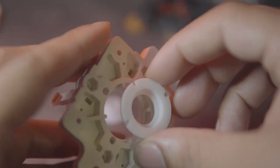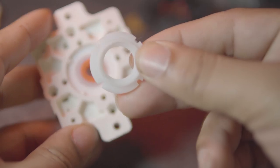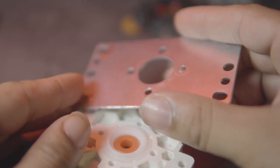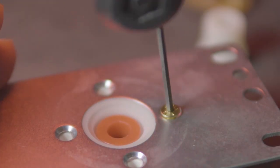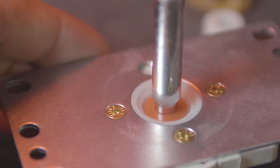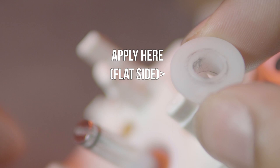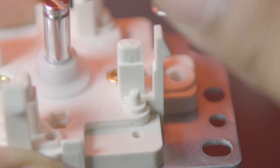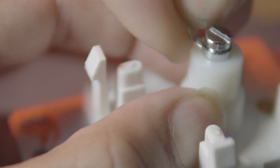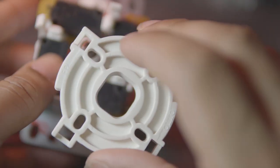From here, grab the body and the corset that's going to hold the grommet system in place, and we can start putting it together. One of the corsets is going to sit on the bottom of the grommet system and the other one on top. After making sure they're all nice and snug, grab your mounting plate and the screws that come with the kit. They are Allen keys, so make sure you have the right tool, and hold the nuts on the back side while screwing in because they will fall out. Feed the joystick shaft through, and don't forget to apply the grease supplied with the kit onto the top of the top hat before putting it on. Slide the spring holder on the opposite end, then slide on the spring, slide on the actuator of your choice — they give you three with 0.5mm increments. Push down the actuator and slide the c-clip on. Install the micro switches, choose your gate, snap it into place, and you're ready to go.